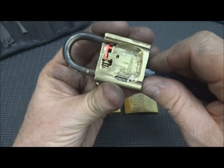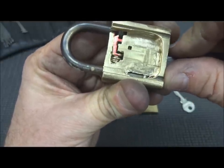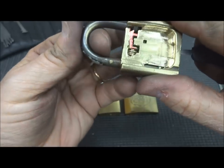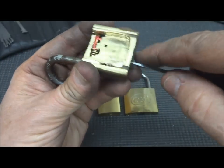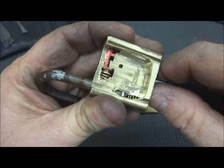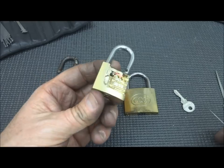Let's lock it and do that again. In through the keyhole — you'll be able to see the tip locking onto that locking pawl and just beginning to move it. When it unlocks, the spring is broken in this one since I machined through it, but of course we get it open. An unshielded lock — this is a perfect example. It just allows us to get in there and actuate it. We completely bypass the lock altogether; the cylinder doesn't even come into play.